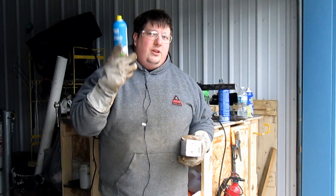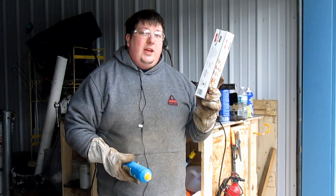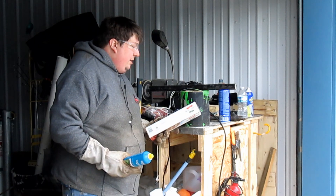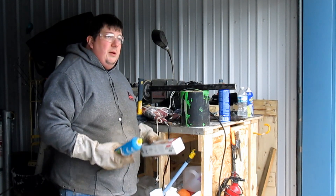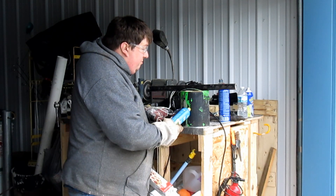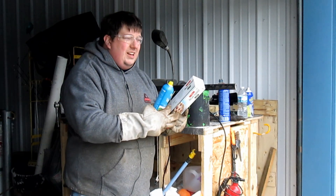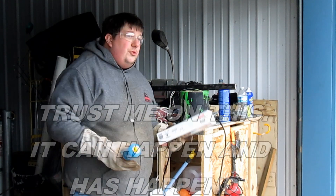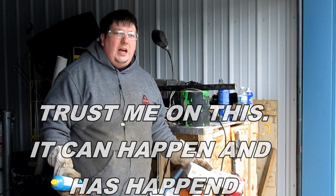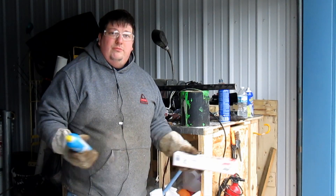If you don't have some kind of lubricant — I use just vegetable oil because there's no chance of any toxic fumes — and saran wrap. What I'm going to do is wrap my male mold in saran wrap, but not before spraying it down with this. Basically, what I'm going to end up with is something I can actually get out. When concrete is in the chemical process of hardening, it actually expands a little bit. If you don't do everything you possibly can to get your male mold out, you will never get it out and you've wasted time and resources. Saran wrap and some kind of lubricant that's not going to poison you — very simple.